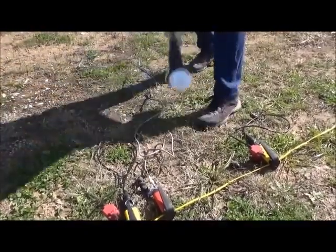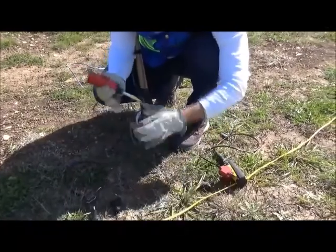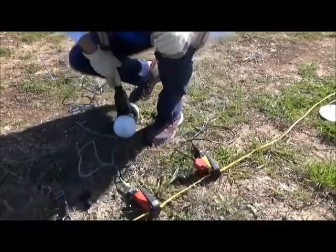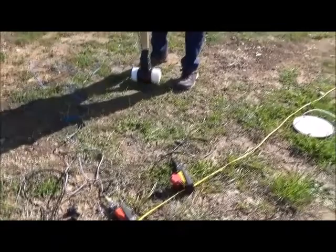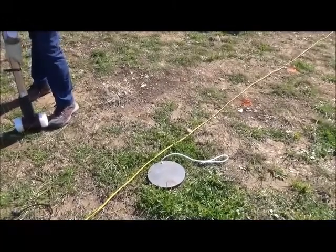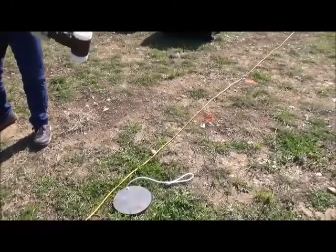The sledgehammer is connected to the cable line. The cable line snaps onto this seismic trigger. The seismic trigger simply snaps to the cable line, and at that point I wait a few seconds before I actually hit the plate. Once it's ready, I can do that, and I can do a number of stacking — it can be 3, 5, 10, or so.